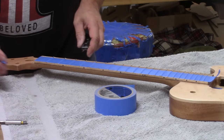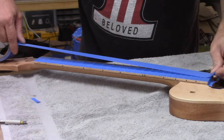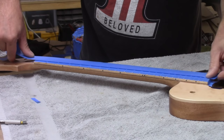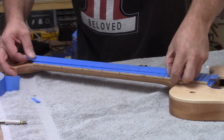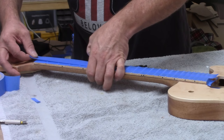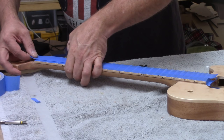And then on the back of these, I've got a really cool little trick I'll show you in a second. So I just fold that over. I do it again on the other side. Hey, keep it down, we're making movies over here. And this is the only reason that I stopped chewing my fingernails, was just so I could do this. The reason that I do this tape first is, like I said, it's going to be the only one that stays on the guitar all the way through the finish process. We'll add more tape and overlap it onto this tape, but this tape will be there until tomorrow when we pull it out of the spray booth. The rest of them will have to peel off at some point.